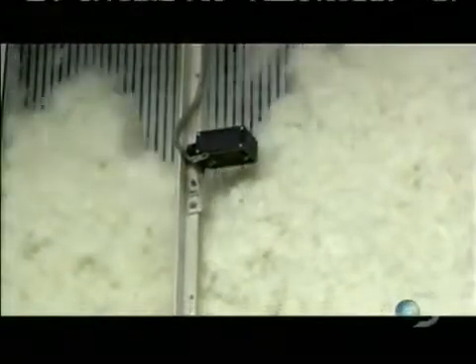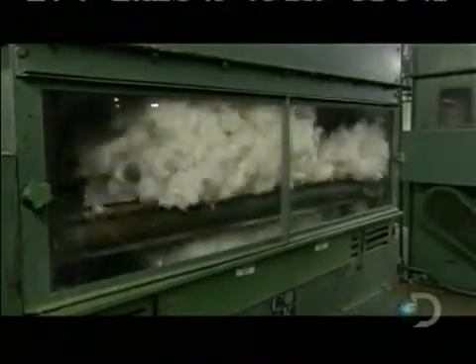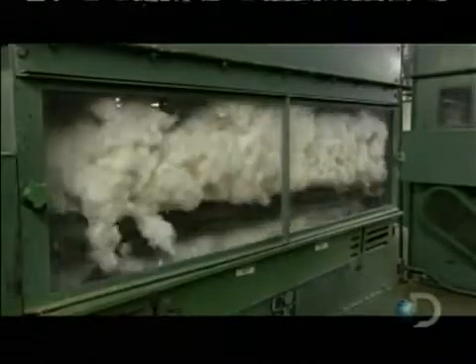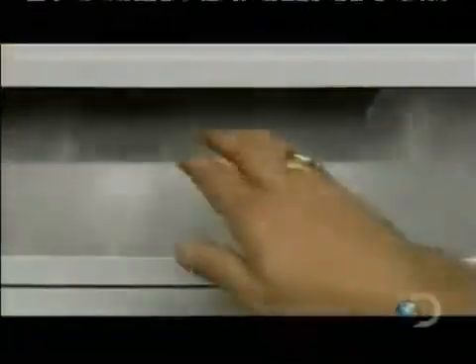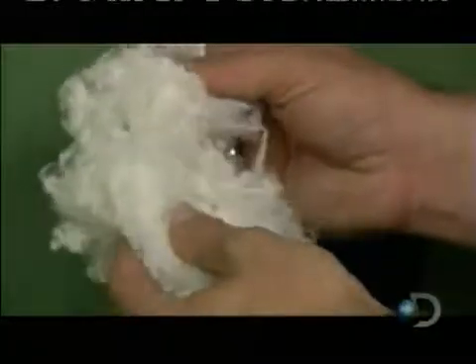The tufts are blown in a 14-hour fluff cycle, getting rid of any remaining fragments. It may seem like overkill, but debris left in the cotton can make the color uneven and, worse, cause thread breaks during weaving. The cleaner the cotton, the higher the grade it gets — and the higher the price. But there's still a long way to go before this cotton becomes denim; first, it has to be spun into yarn.